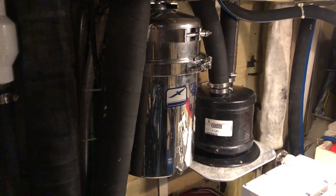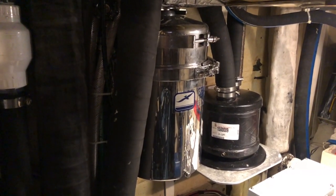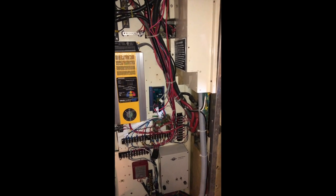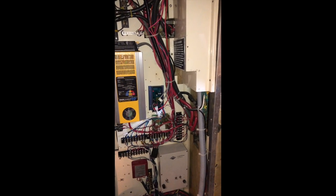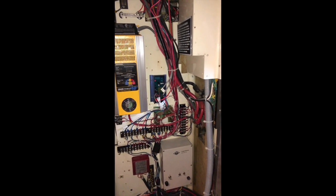There's a huge Seagull activated charcoal filter — it filters all the water in the boat from the tank, so if you pick up some bad water, this filters pretty much anything out, including bacteria; it will even take Giardia. The wiring for the engine harnesses and the voltage regulators — you can see the voltage regulator right there for the alternator. And then there's one of our three 40-amp chargers. You need a bunch of chargers because if you have an AC generator, you don't want to be running it for hours trying to charge the batteries because you can't charge them fast enough. The gray box at the bottom is the refrigeration controls.